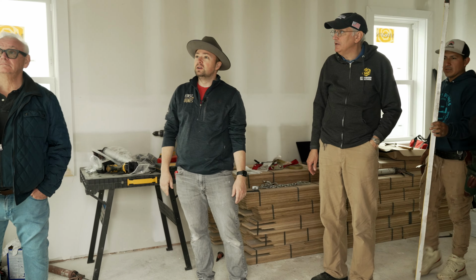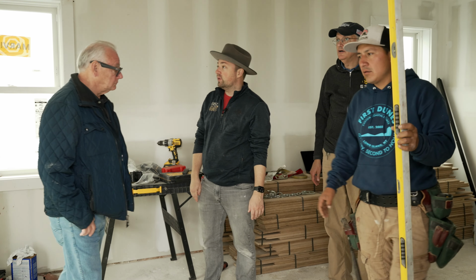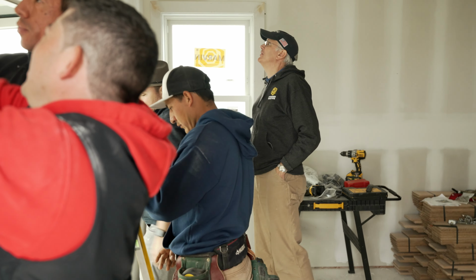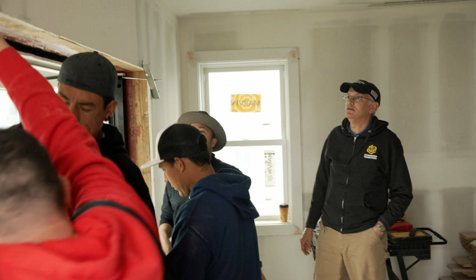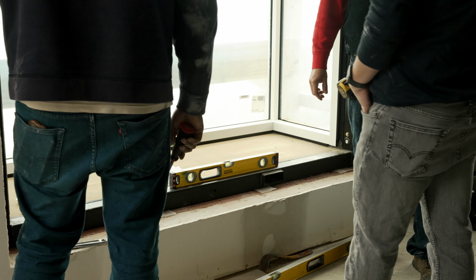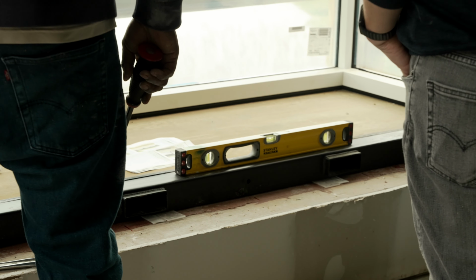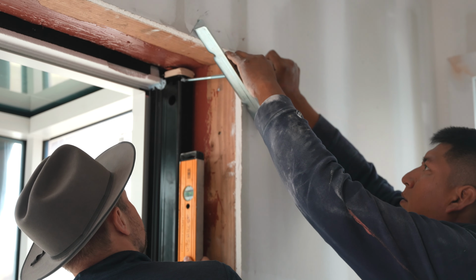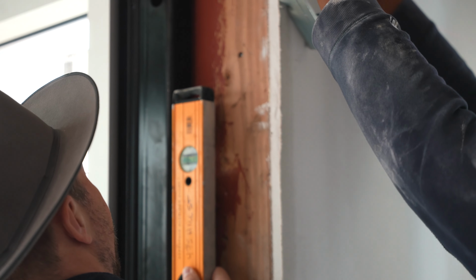It looks like you have room at the head. Yeah, we have a little room. We have the caps of the steel there. See, it's about a quarter inch, more than that. So now we're gonna start leveling and such. A little low on that side, yeah. You want to wait for the 4 foot level? Or do you want me to? Yeah, we're getting a 4 foot level up here. This is a little bit of a small level. Yeah, we should. A little more.